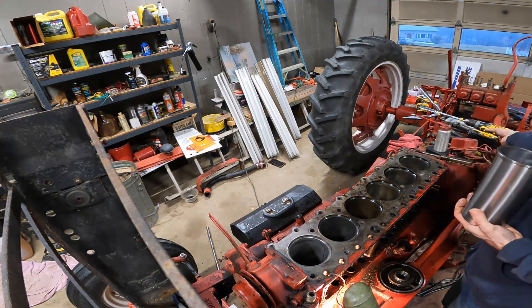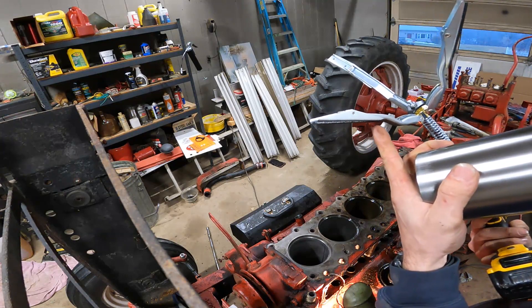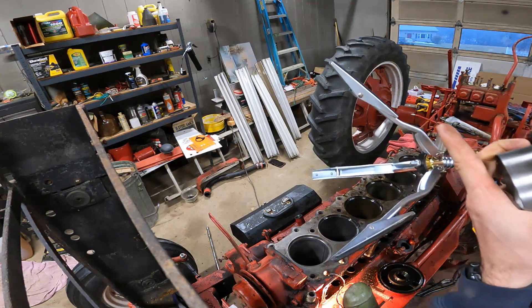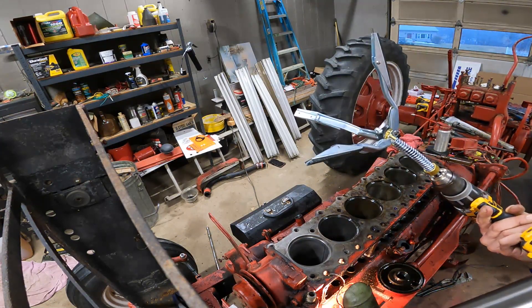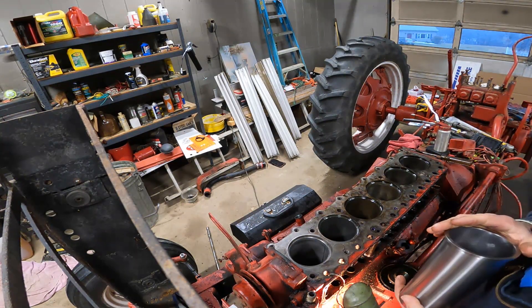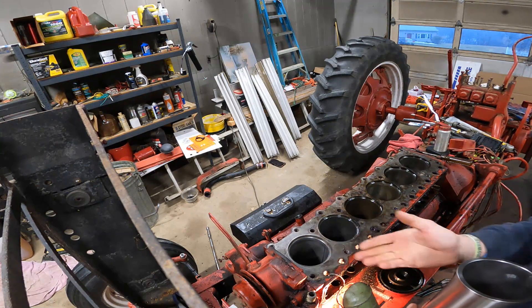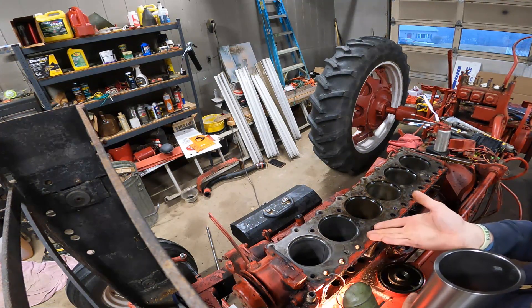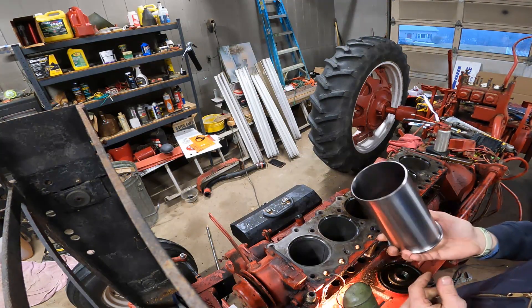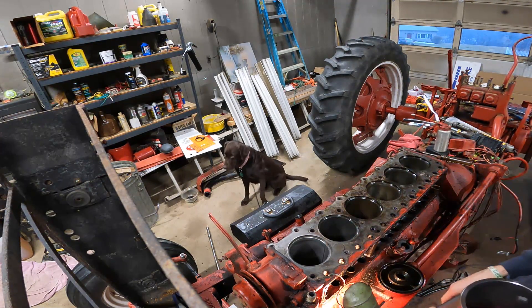I think I'm going to have to get a new hone. For whatever reason, it almost has the stone wore off right here, mainly just on this one. The others are worn thinner but this one is almost down to the metal. I pretty much have all the cylinders still to do - this one is close to done but the rest still need more honing. I'll throw this sleeve back in the freezer and try to heat the block up a little bit.